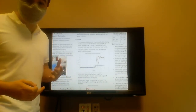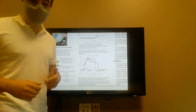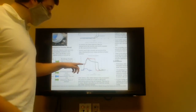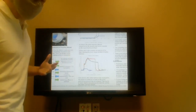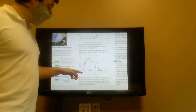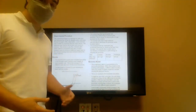The prototype was able to redistribute that pressure away from the system, but after a few bits of experimenting, we found an issue in that after water hammer propagated, if we were working under a closed system because we shut the valve off, the pump — or in our case the faucet — would still generate pressure, and in the case of the control and water hammer arrester, it nearly doubled the pressure past the water hammer spike. But because our prototype was able to move that water out of the system, it's not a closed system anymore, and the pressure was able to stay under 10 psi. As you can see in our data, control and arrester reached about 80 psi, but our prototype was able to stay under 10.